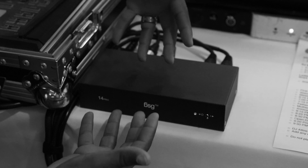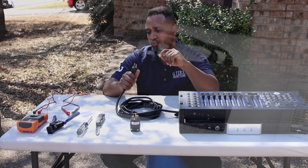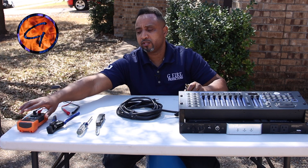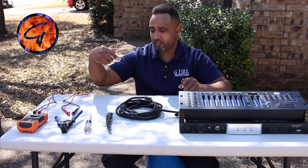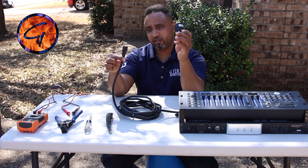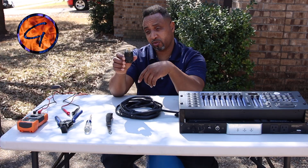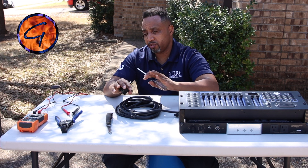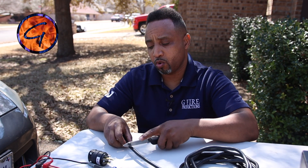When I turn the GSG to the on position, the DSP kicks in and I can hear the difference in the sound. Just wanted to share that troubleshooting tip if you run into anyone making that complaint — that was my solution. This box makes my QSC sound phenomenal. So what we're going to do is replace the plug. The tools I'm using are a multimeter, wire strippers, a screwdriver, and a knife to cut the cable. I'm replacing this end of the power cable with a new plug from my local home improvement store. Let's go ahead and cut this cord off.